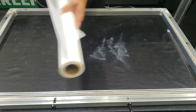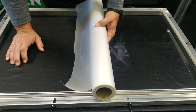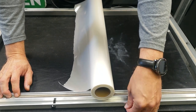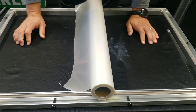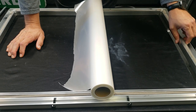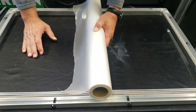I'm right handed, so I'll start on one side. I'll try to set the video up so you can see it in the middle. If you'll notice, the mesh is just a little bit not quite as wide as the outside edge of the frame. So you want to make sure that all your tracks are loosened up completely and pushed towards the center. There are a couple important reasons for that — if you have a little bit of a cant on it when you go to tighten, it's not going to tighten in a perpendicular manner. So you have to make sure all these are loosened up and pushed in. I'm going to visually line the mesh up centered.